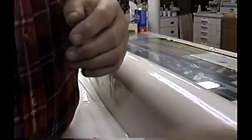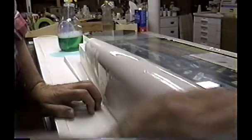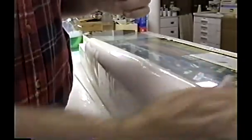Shame is because of the shape of this mold, almost guaranteed, we're going to lose this plug. All the work I put into it is really only going to translate out into one mold. If I didn't have that little recess in there, I might be able to get away with saving the plug, but I doubt it. That's coming off.